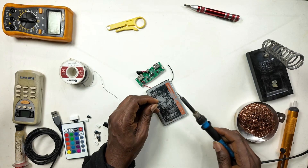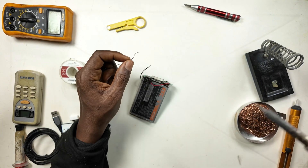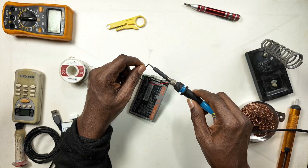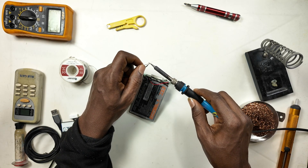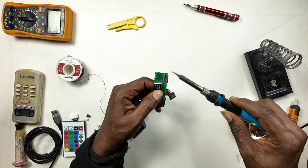All you need is a lead and a soldering iron, and that's all. An average person can do this. You have to put enough lead on the contact of the battery to make sure it doesn't come off quickly. Make sure the cable is well touched with solder lead.